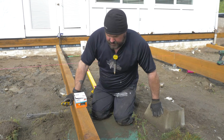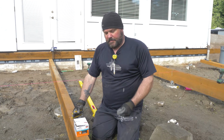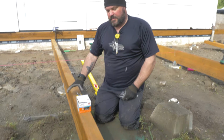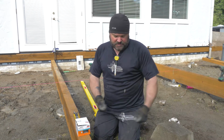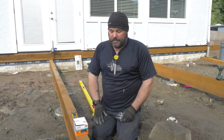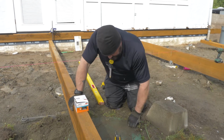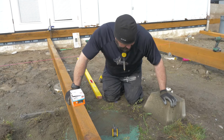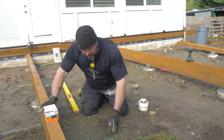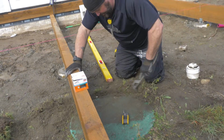These are the septic tank lids for the sewer for the house. So we're building over them, and we're going to have access to them through the top of the deck. But I've got to make sure that they can get to them. This beam is a little bit in a precarious location. He only has to get to this lid once every 5 years, and it's okay to have stuff over it as long as they can scoot the lid out. So once we get this to elevation, then we'll be able to determine if the lid comes off or not. That's what I'm doing right now, getting things ready to check it, because I've got to make sure we can get this thing out of here. It looks like most of the stuff's been removed at one point. We might have to do a little digging and make sure that this thing can come off. That's what I'm doing right now while Phil's getting the post ready.